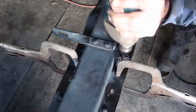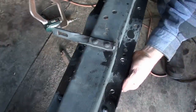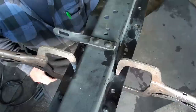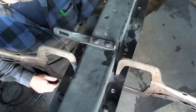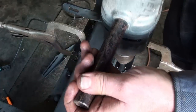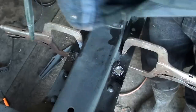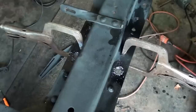I've already done my center punch. There's my pilot hole. I've got to make those bigger — much, much bigger. I didn't push the record button correctly. First, run it up to seven-sixteenths on both sides, then up to three-quarter. And on to the other side. Plate number one.